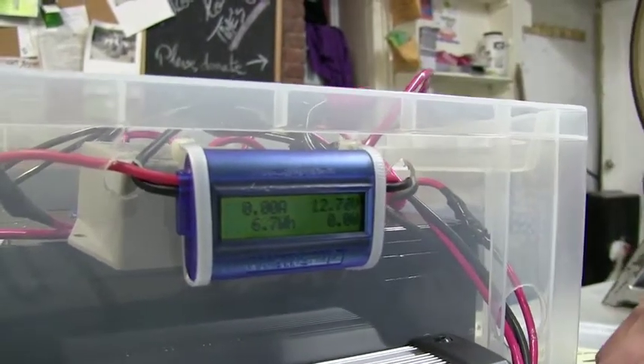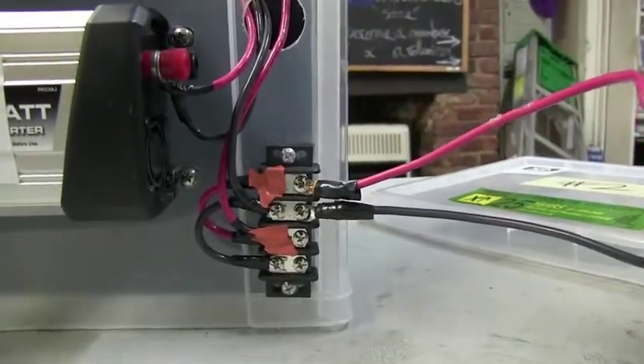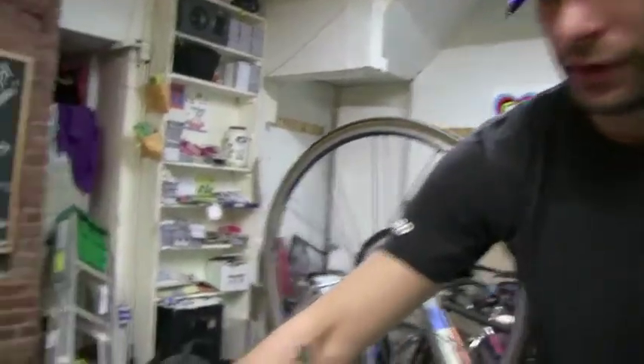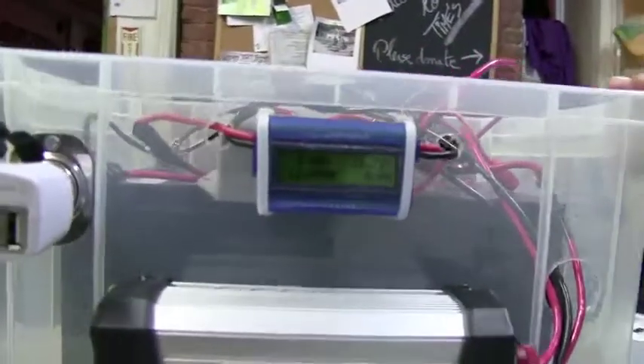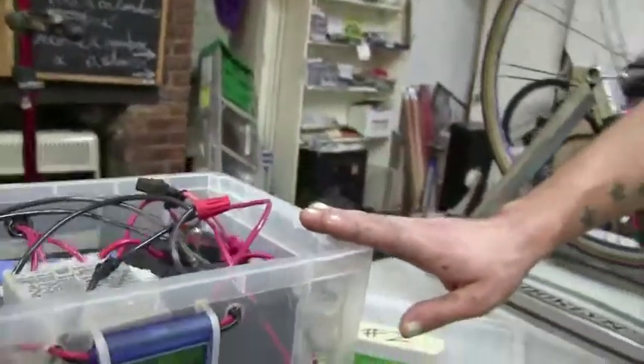That's why we had these boxes with the terminal blocks — because we could detach the bikes and easily move it, bring a new battery box in, and hook it up. Very simple, very user-friendly. Basically, media was the only working group that was ever discharging more than it was charging the batteries. So when they discharged the battery below 11, we could swap it out with other working groups, such as Kitchen, which was just running one LED light and thus generating a lot more electricity than they were discharging.